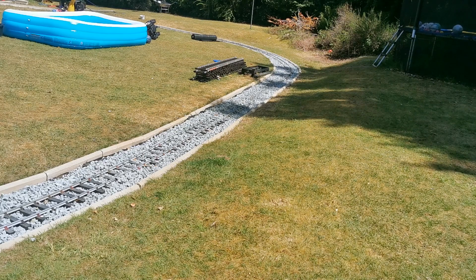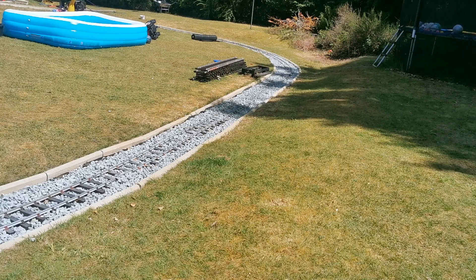The stone will settle itself in time, and then I'm ready for the final stage. There's a quick preview: I'm going to find the levels on this layout - I already know roughly where they are, but there are some areas that are dips, not too huge, maybe an inch or two. I just want to lift them slightly, put some more stone underneath, shake the stone away from the rails, lift it, and it will settle underneath.